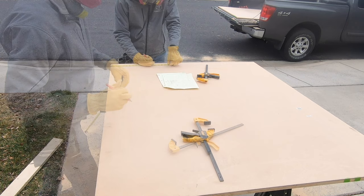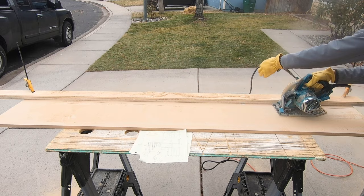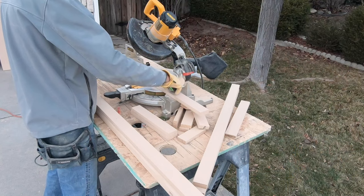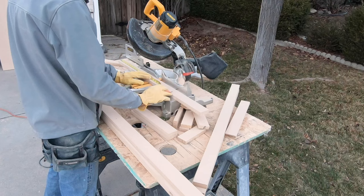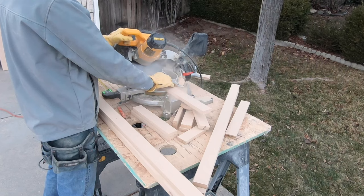To make straight cuts, use a straight piece of wood as a guide and clamp it to the table. The width of the shelves can be as wide as you'd like — for this project I'm doing twelve inch wide shelves. You'll also want to cut strips of MDF to use as shelf supports so you don't have to use shelf brackets. This is cheaper, easier, and better because shelf brackets often get in the way. Cut the shelf supports to at least two inches wide, but you can go wider if you plan to mount something to them.